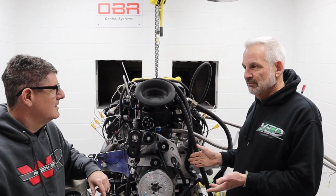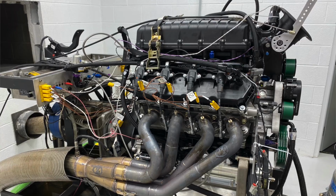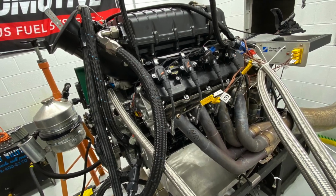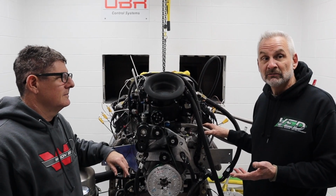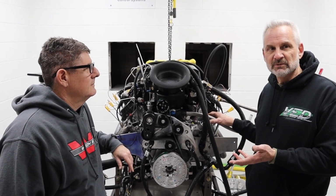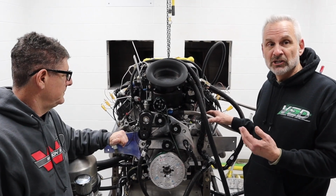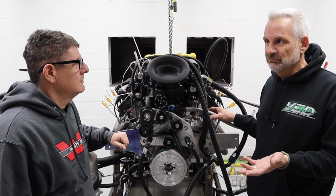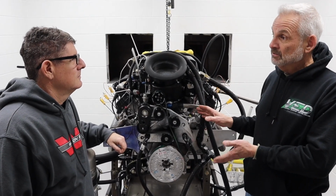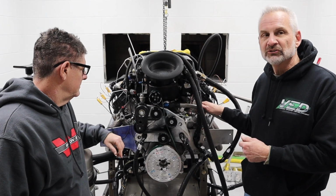We've got the stock 7.3 truck block in it. Right. We've got the stock 7.3 truck crank in it. We've got the stock cylinder head castings that were heavily reworked by Visner Engine Development. These are what they call the Stage 3 heads. There's a 2 1/4 titanium intake, 1 7/8 titanium exhaust, shaft mounted Jesel rockers, Jesel keyed lifters, a Charlie Westcott mechanical roller cam in it, stock chain timing system. We're hoping to get a belt drive system for this thing pretty soon.